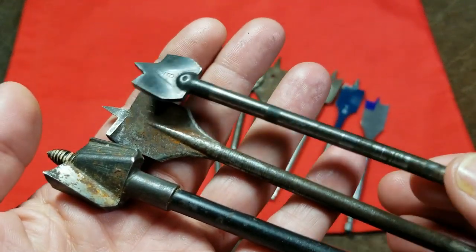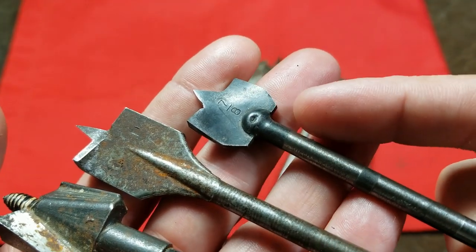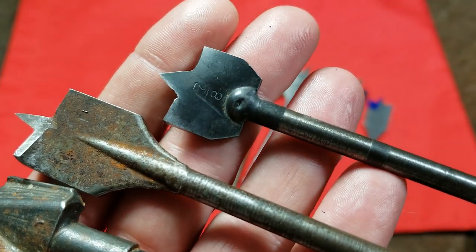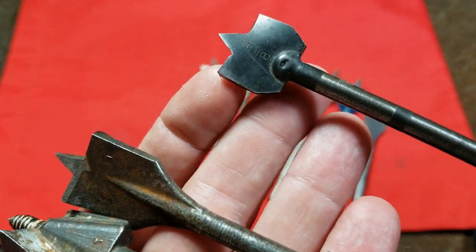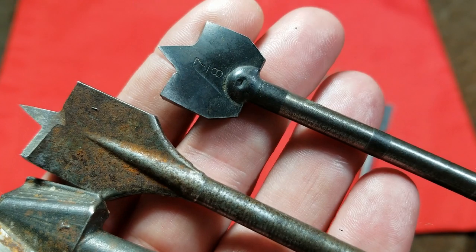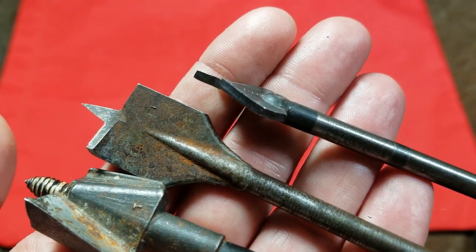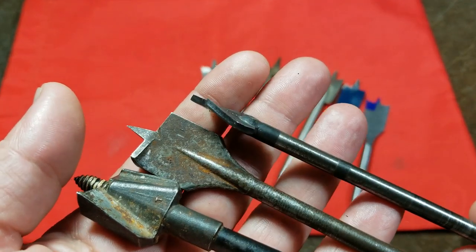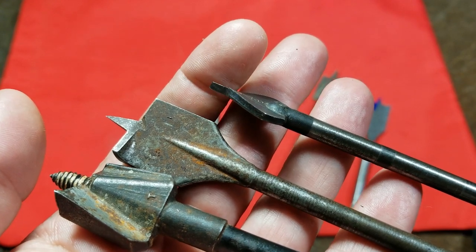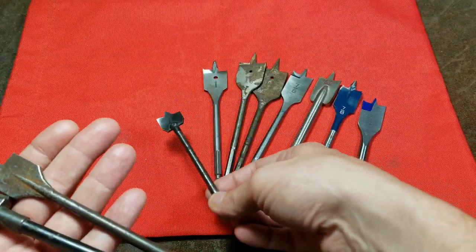I only know the brand name of one of them, and I'm sure they're all old. This one's interesting because it's an expensive manufacturing process — they're welding a piece of steel onto a shank, which is a whole extra step. They were simple, but I kind of like these because they have a very slim and narrow head. What they do to provide additional rake angle so that it cuts more efficiently — they just twist a piece of metal and then they bond it. I thought this one was kind of interesting.